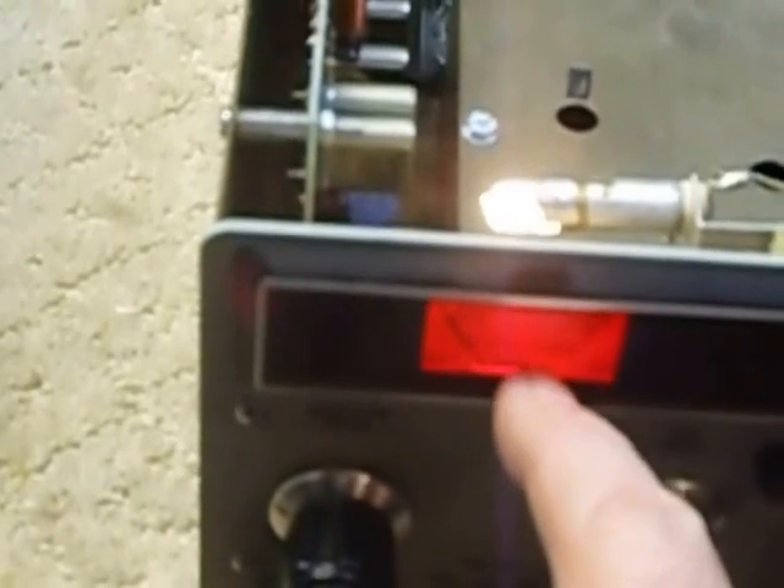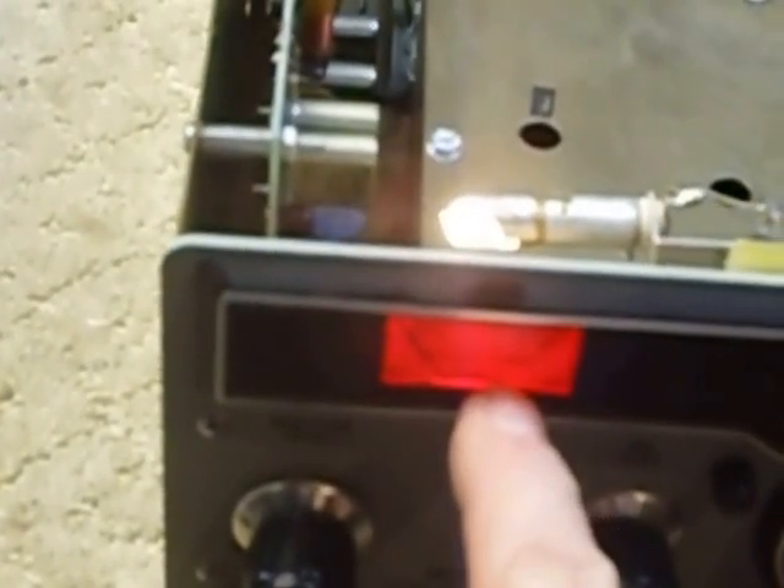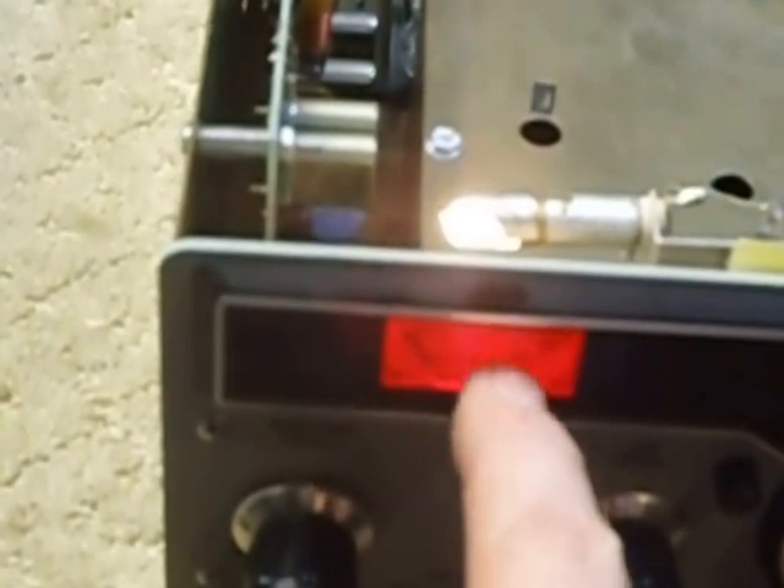You want to keep your plate current down — I try to keep it about 200 milliamps. There's no sense running it wide open all the time; if you do, you'll be buying a lot of final tubes, and those 6146 tubes are expensive. So I just adjust it so it comes up halfway. I've got it on 80 meters right now.